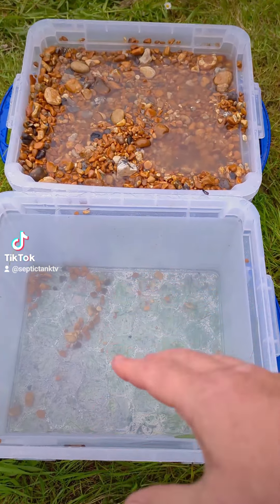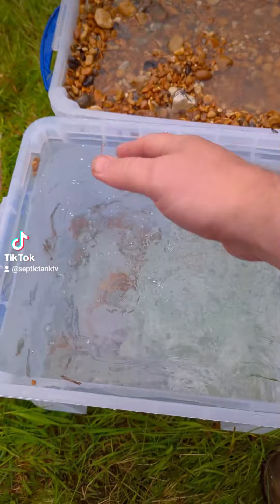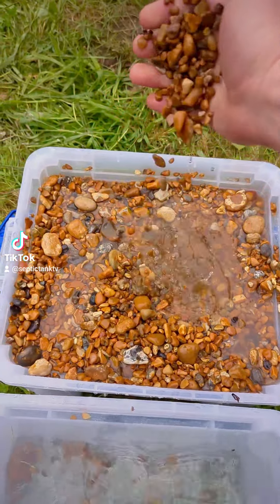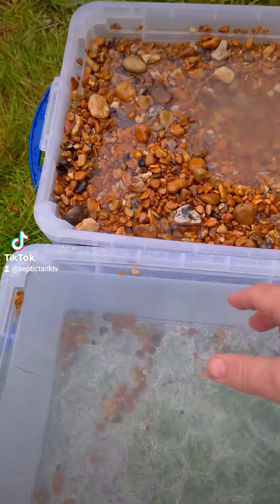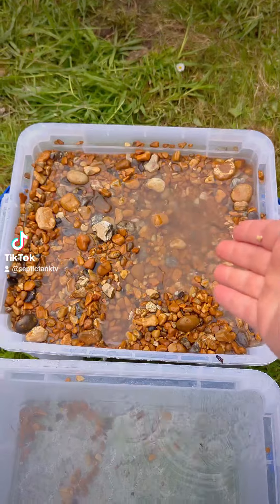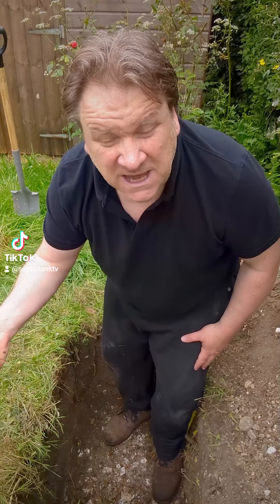So what's my point? If you've got a hundred percent cavity, that cavity can fill with a hundred percent of water. When you fill a hole back in with gravel, sand, or shingle, you've just done exactly that — filled the hole back in. So instead of having a hundred percent cavity, you're left with about three percent cavity. You've just filled ninety-seven percent of the hole back in.